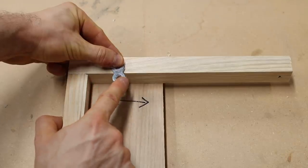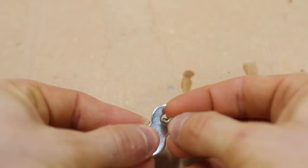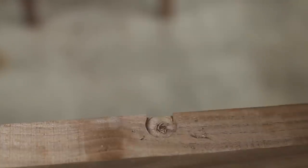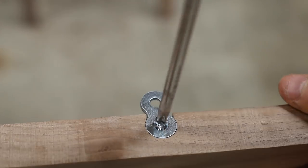That's why we use pivoting figure eights or another fastener that accommodates this movement. I can follow up the forstner bit with a small drill bit for a number six screw, putting the drill bit in the point the forstner bit left. A link to everything I use in this video is in the description if you'd like to check that out.